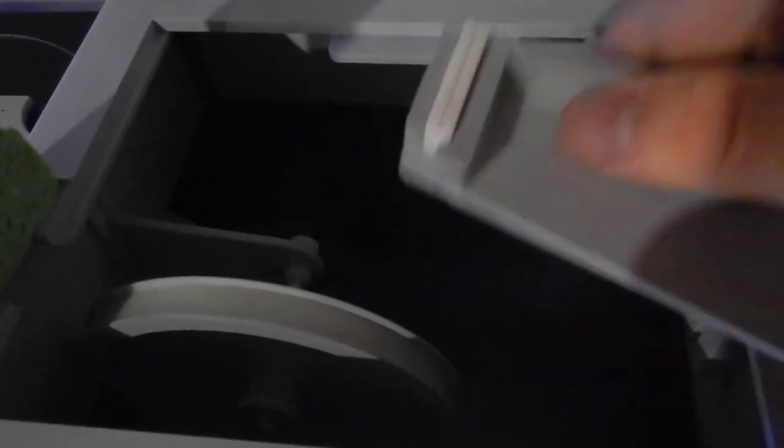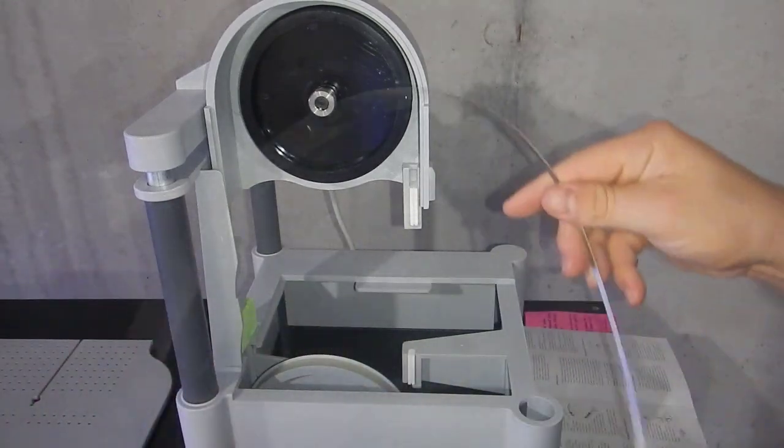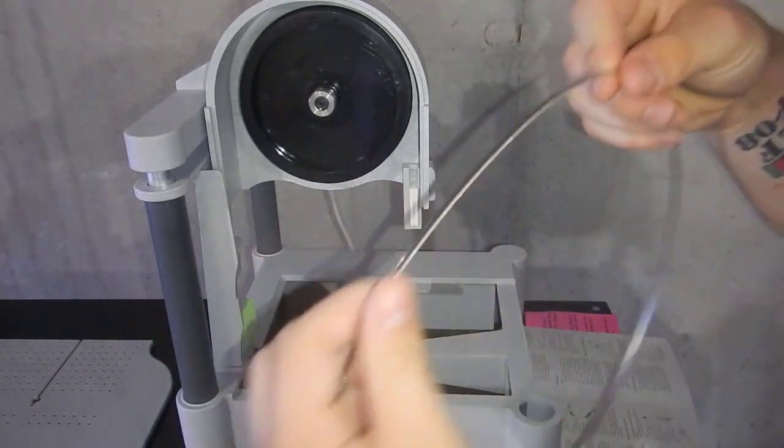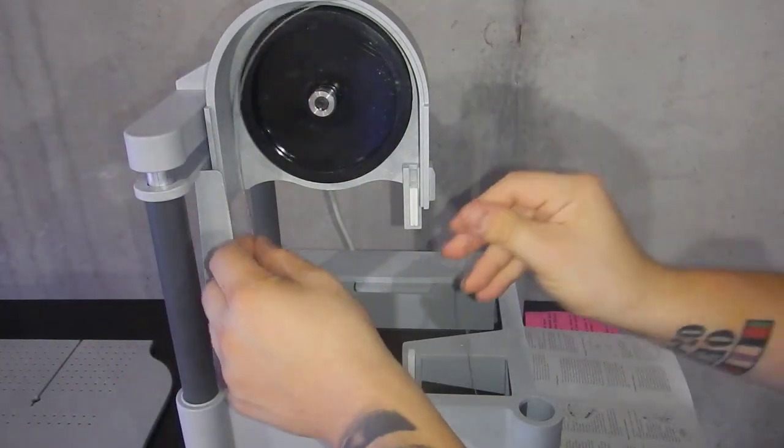Once you have everything set up, you're going to add the blade. You want the cutting edge, the diamond edge, facing you, obviously, so you can push the coral against the blade and have it cut. What I like to do is put the top on first and then slide it underneath the bottom. You can rotate the wheel if you want to make it a little bit easier, but if you lowered the upper receiver far enough, it should just slide over the bottom wheel without any issues.